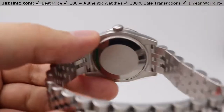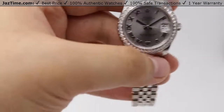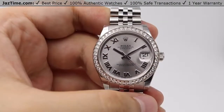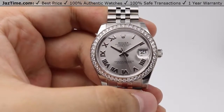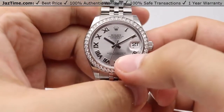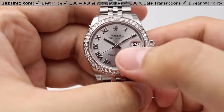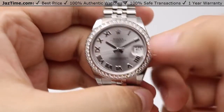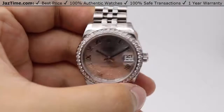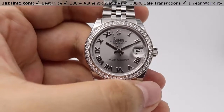Let's go ahead and move on to the movement now. The movement is housed in this oyster caseback, which has a nice bordering of high polish. It's Rolex's perpetual mechanical self-winding movement — a caliber 2235 movement, which is an in-house movement made by Rolex with a precision of minus two to plus two seconds a day. This is within Swiss specs, which gives it the superlative certified chronometer designation shown at the six o'clock position on the dial. The functions include the center hour, minute, and seconds hands, with instantaneous date changing and the ability to stop the seconds hand for precise time setting. The power reserve is 48 hours, meaning you can put the watch down on a Friday evening, pick it back up on a Sunday afternoon, and it will be keeping time just fine.